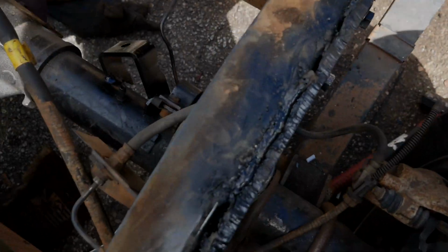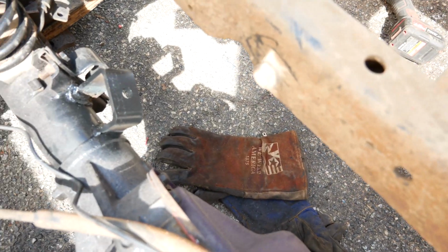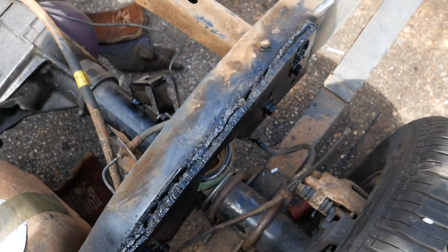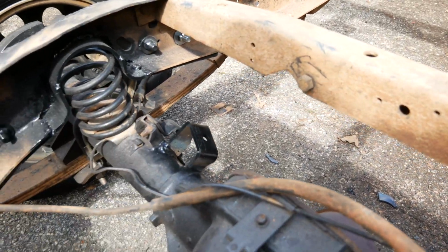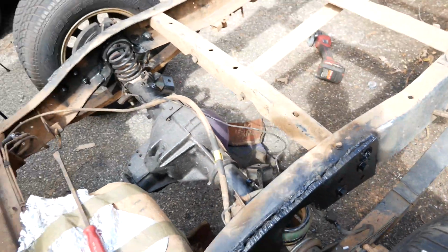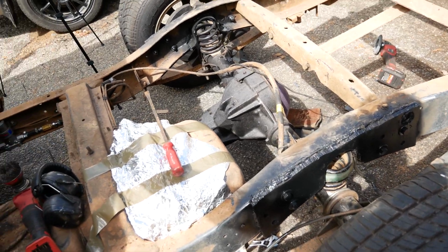That's a wrap for those shock mounts. It's as easy as that for throwing them in and welding them in. Those will hold. As you can see, I double passed and triple passed some spots that needed it, and they point right up to where those upper ones are going to be. Those are going to be some little shocks. I don't do lowered cars that much. I usually do 4x4s, obviously, so those are like some 6-inch shocks. That's crazy to me. But yeah, that's it.